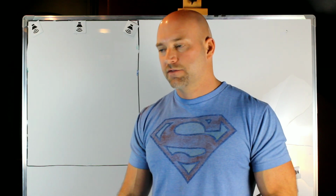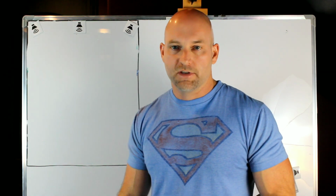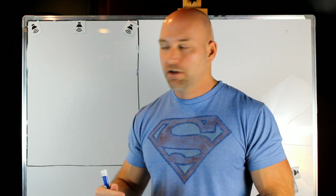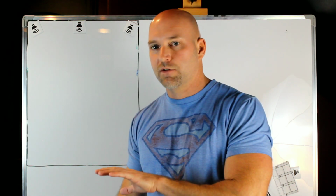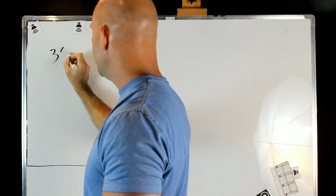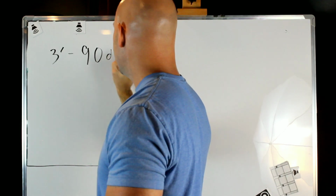But we're going to say, just for argument's sake, that we're getting 4 dB for doubling of distance. Say the room is open on one side, so maybe it's a large room, you did some acoustics. So we're going to go with 4 dB. That's probably a lot safer and more realistic. Okay, so let's take our same speaker that at 3 feet we had 90 dB.